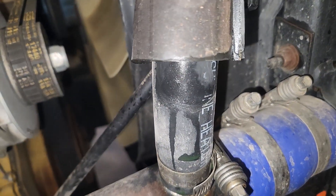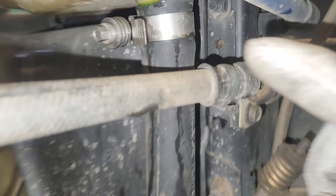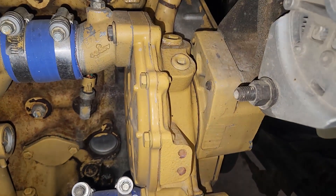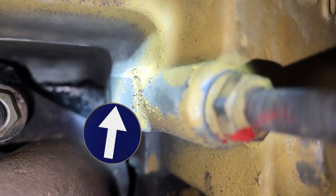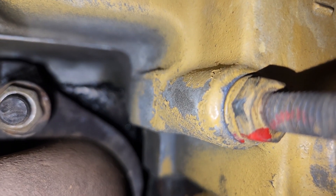This one, like I said, is already dripping on the ground. What you're going to do is whenever you find a leak, work your way up to the highest point where the leak's coming from - that's where it's coming from. This one, we've got an expansion tank leaking here; it could be a loose clamp or the plastic housing's cracked. And then we've got one under the engine itself. These are usually a little harder to find, so work your way up. This one is the water pump - this is a diesel engine, CAT C12 - but it ends up being this water manifold right here where it pulls to the cylinder head. That's not the head gasket, but the water manifold is difficult to do on this engine.